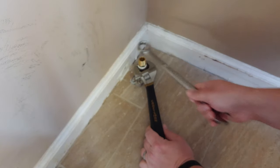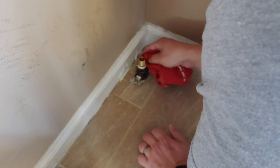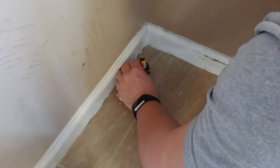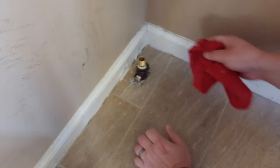All right, there we go. Nice and tight. And we'll check for leaks again once we've installed the entire gas line and turned the gas back on. And to help with that, I'm just going to wipe away a little bit of that extra pipe dope so that when I add the gas leak detector, it will have the ability to see the bubbles